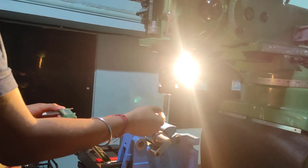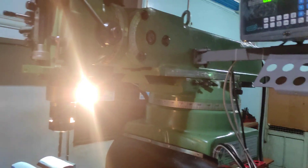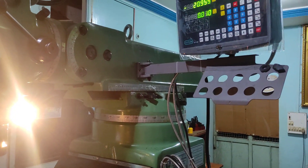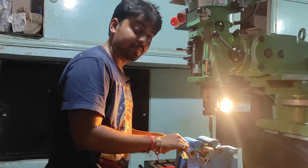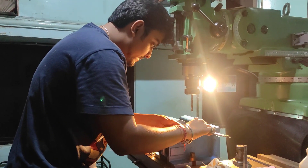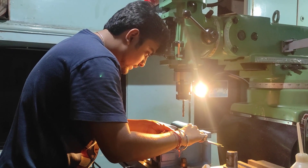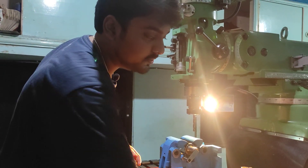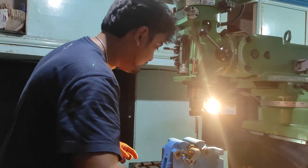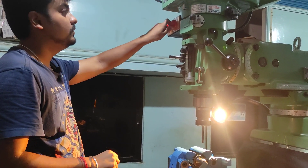I will check the length with the help of the vernier caliper. There are totally digitalized numbers displayed here — whenever I make an axis change it shows up on the display. So with the help of this vernier caliper I am going to measure it. The reading is 19.10mm, which is according to the design geometry, so we are good.